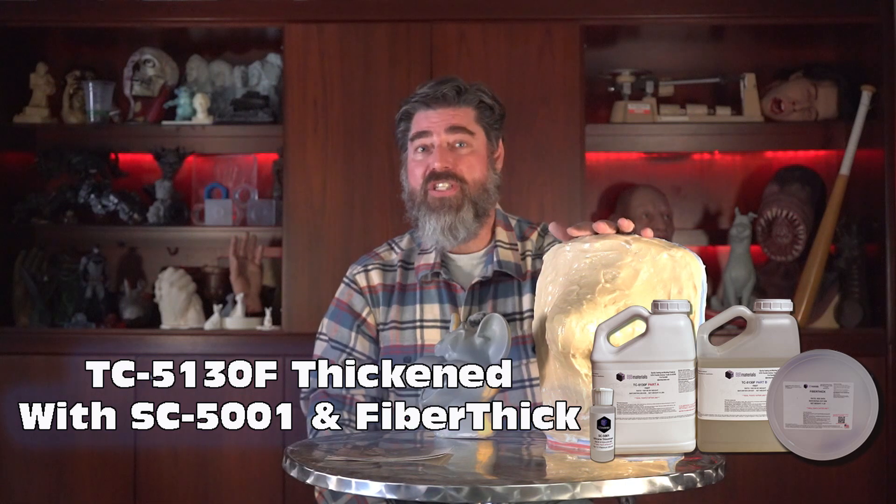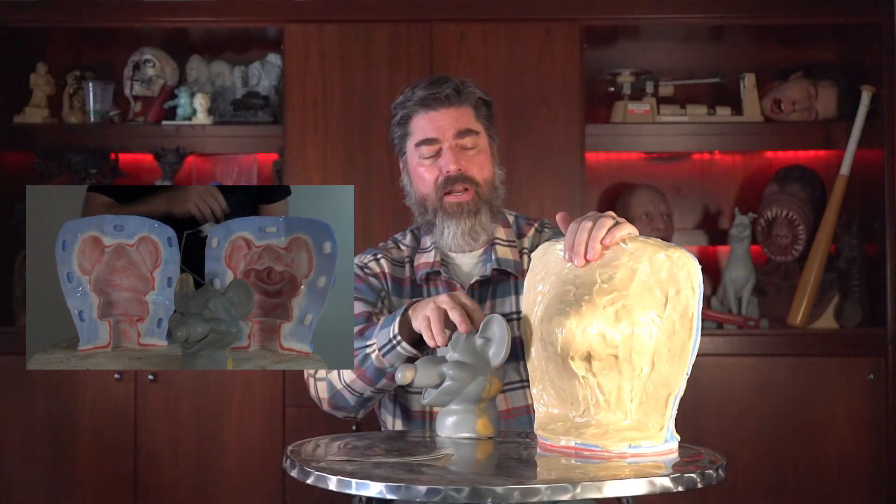I hope you all stay tuned for that — it's going to be a fun two-part video. I'll be making the silicone mold in part one, and then in part two I'll come back and make the resin mother mold over the top of that. That gives us a nice lightweight mold — and if done correctly, you can see the parting line there, and when tightened up it can just disappear, giving us a really clean parting line. The first part will be coming out late this week. In the meantime, be sure to like and subscribe, click the bell icon so you get notified when I post new content, and thanks for watching and supporting the channel.